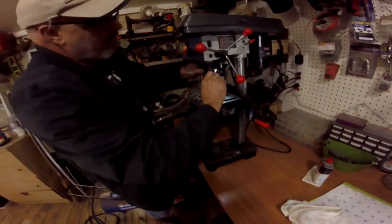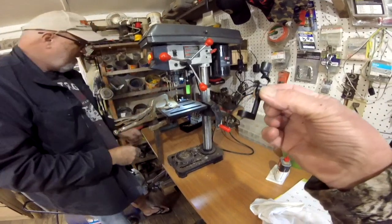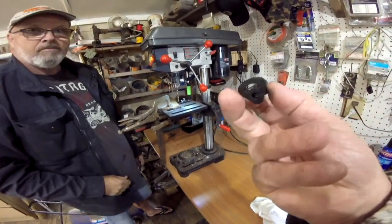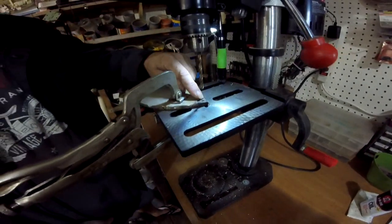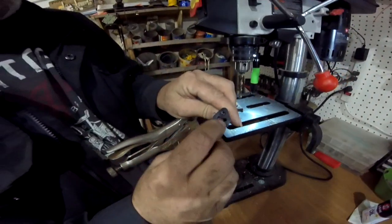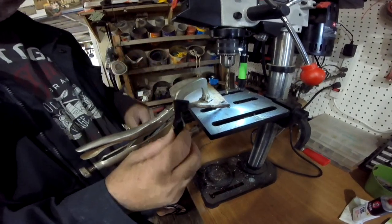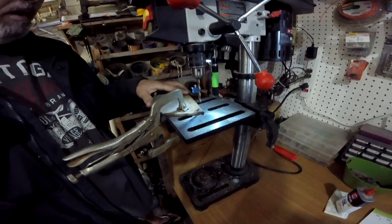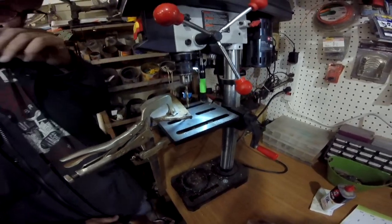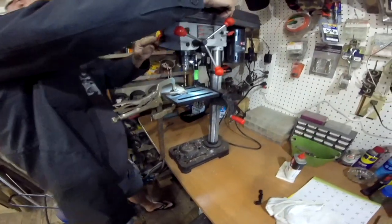Now, what Scott's doing is we're going to fabricate this piece. Working on the base piece here. Getting the holes drilled first, and then we'll cut it off with the... It's on the bottom of it. Yeah. You can see the slot right there and the little hole, which we're transferring to this piece of stainless, and we'll trim it out when we get done. Yep, then we're going to make the whole thing out of stainless steel. Yep. Weld it all together, and that will be not a problem ever again on that motor.